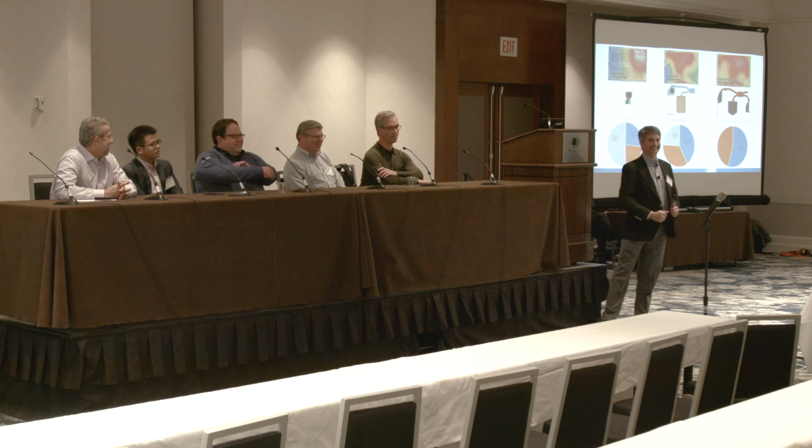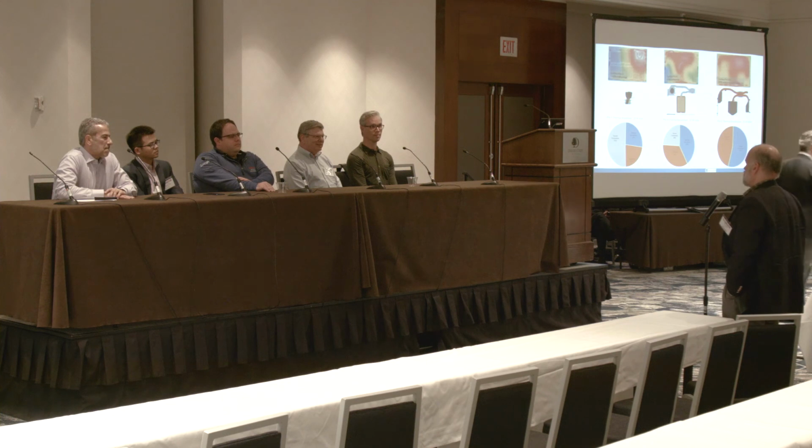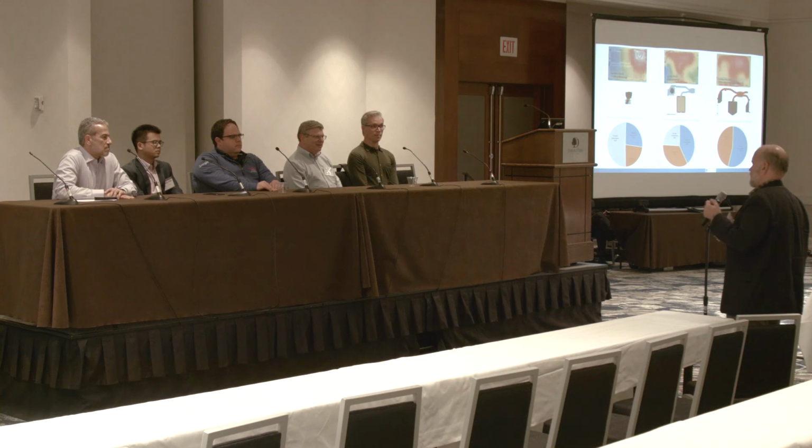Bruce Kennedy, formerly of Oracle, now Rogue. So I'm wondering, in terms of the dynamics of transients, to what extent is performance metering used to keep a certain temperature within the device? And in that same vein, to what extent are people considering using phase-changing materials? Here again, just emphasizing the need for a constant temperature and dealing with dynamic loads. Any comments from anyone? Andy, you and I have both looked at that.